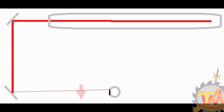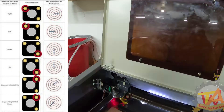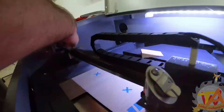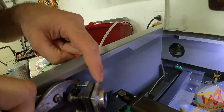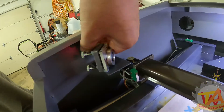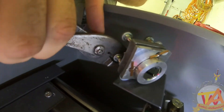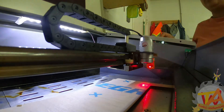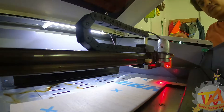Now we know the problem — we have to adjust the second mirror so that it hits the center of the third mirror. From where it was originally misaligned, I had to make a move left and then up. I had to adjust the diagram to match the controls on our mirror since ours was slightly different than the original, so there was some trial and error in understanding how our mirror adjusted. I ended up making the slight mistake of adjusting the diagonal portion of the mirror, making it hit towards the lower left side, then readjusted to try to get towards the center. It wasn't quite centered yet, so we needed to move the mirror up. We replaced the tape and tried the procedure over again, slowly creeping up towards the center of the piece of tape.